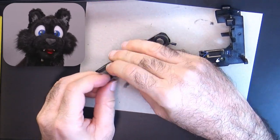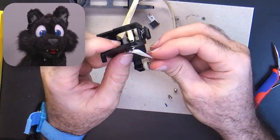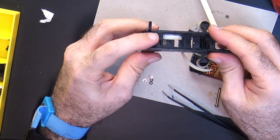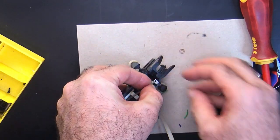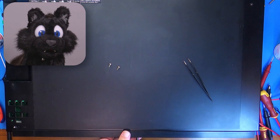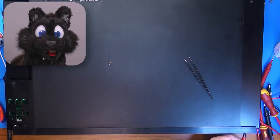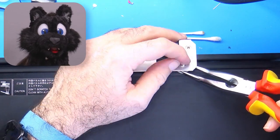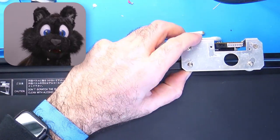The pen assembly was a bit fiddly. It contains the pen holder, which is moved up and down by a solenoid. That in turn has an adjustable spring to set soft or hard pen down mode. Now to remount the tracks for the X-axis — this tight fit, I should have put down the mat later, but it works. Adjusting all the wheels so that they ride on the rails without binding was quite a bit of try-curse-repeat action.